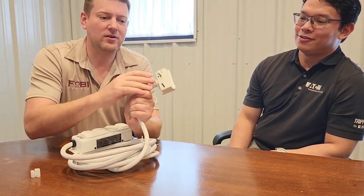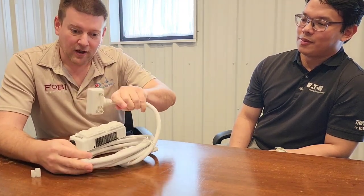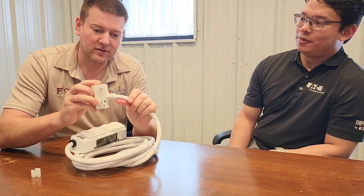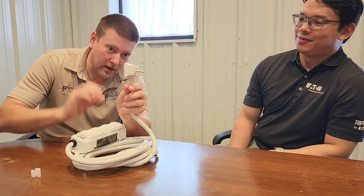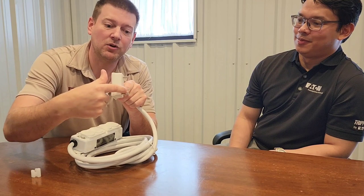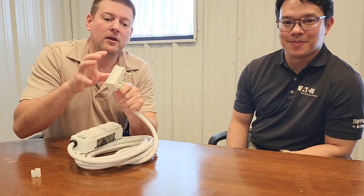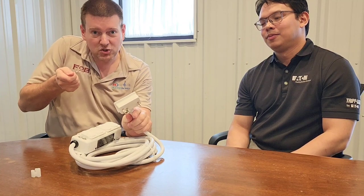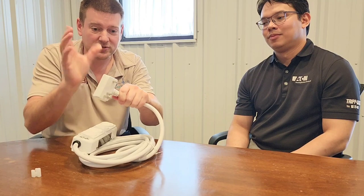This plug right here, you can see it's got a sideways configuration. So if you have the correct upright or, in medical facilities, the inverted plugs, it's got a sideways orientation — and check out the profile on that plug. You can actually get a very comfortable grasp on it. And since you have a redundant ground, you're going to have extra plug retention that you wouldn't normally experience in an outlet. And because it's got a sideways configuration, instead of normally pulling it straight out, you would actually cantilever it by grabbing onto the cord — so you're supposed to grab onto the plug and pull it straight out.